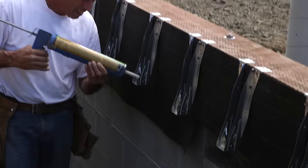When I say a rough pony wall, I mean the spacing of the studs is not uniform. Rather, we pretty much put one stud underneath each joist. The studs are held in place by a pressure-treated bottom plate and a top plate, and they are transferring the load of that individual joist, which is very light, down to the top of the footing. The footing doesn't know anything's happening. The floor will be stable, it will be silent. These things are nailed together and nailed to the joist, so they're not going anywhere. And it's an example of behind the scenes, the tolerances can get somewhat wider and the function can remain perfect.